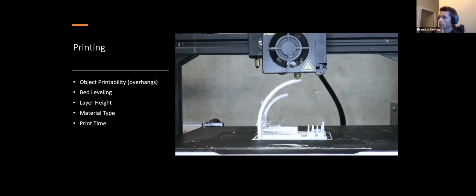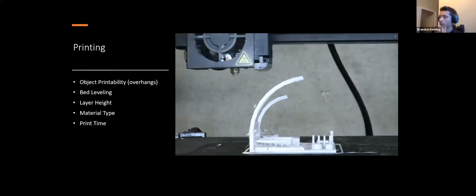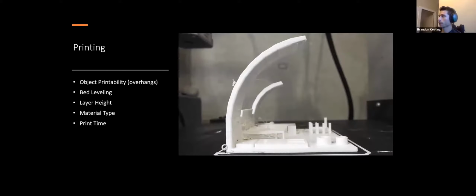But yeah, generally the major considerations of 3D printing are really just the time it's going to take, how strong you need it, and all that stuff. Yeah, that 0.2 millimeter layer height isn't bad. So this is an example of a test print. This is kind of really seeing what your printer is capable of. An overhang like this is generally pretty tricky, and you could see the longer, less neat layers from printing at such an angle. It's essentially printing over nothing very briefly.